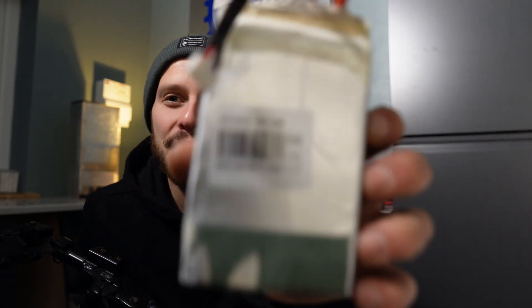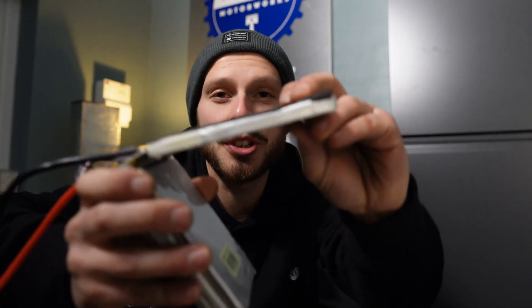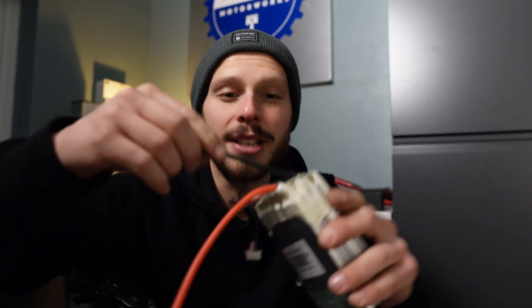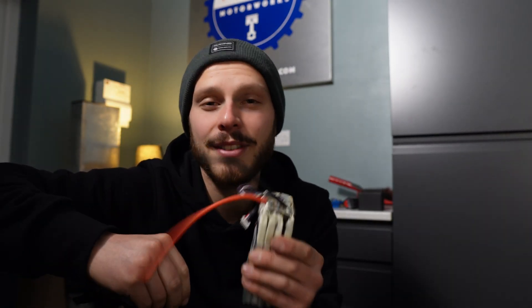This has been really interesting. I put the actual numbers from these cells into the internet and nothing came up — I'm assuming they spec a specific battery from the company for their product. I know they're lithium polymer pouches because they're always soft and slightly pliable with two tabs for the negative and positive. Speaking of which, they are directly mounted onto the battery. This means there's no management for the discharge, which makes it very easy to fully discharge it — a big cause of failure within these lithium-ion batteries.